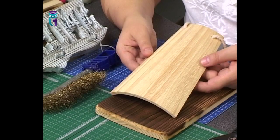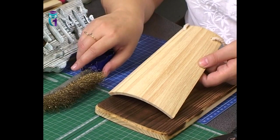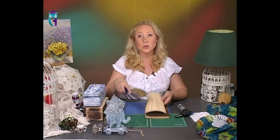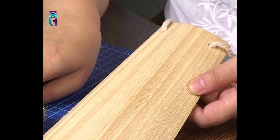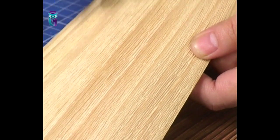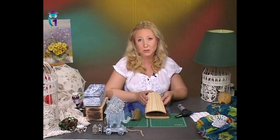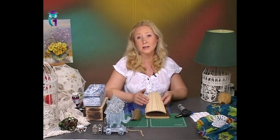So, we begin with brushing. What is it? It's all written correctly in the encyclopedia. Brushing comes from the English word brush. It's a special and non-standard process of wood finishing, and it consists in getting out soft fibers from the top layer of wood with a special brush. As a result, we have a surface with a colorfully expressed structure of growth rings. It's possible to call it the God effect, if painted in an appropriate way, an artificial aging, as time influences unprotected wood similarly.